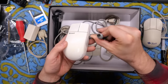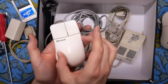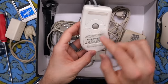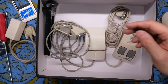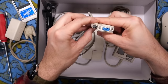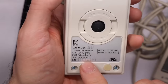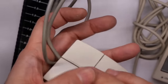A Microsoft bus mouse — no PS/2. I like this shape. This is not the Dove Bar style — it's the later ergonomic one, but only for right-handed people. On the bottom it says 'serial mouse port compatible mouse 2.0,' so with the right adapter this works with a serial port as well. Then we have a small adapter — DIN 8 to 9-pin — that's for a Macintosh. And we have a super generic looking serial mouse. Oh, no — this is actually from Logitech. Logitech was making mice like this — just cheap plastic stuff back in the day — and it is absolutely just a normal serial mouse.